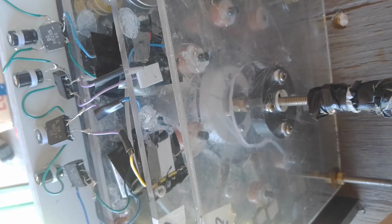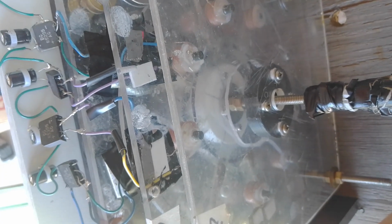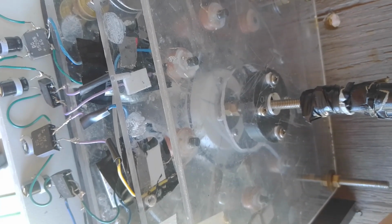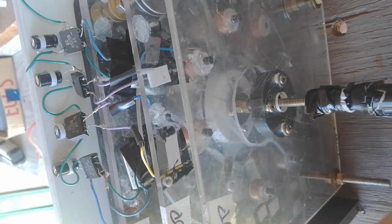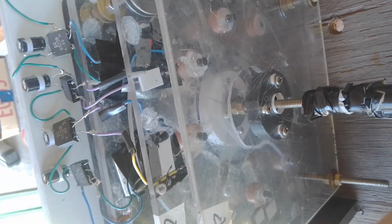And I did this yesterday, but I forgot my camera. But I got 84 volts and 314 milliamps. We'll check that out. That means when I crowbar it for the maximum amps, which means there's no voltage, I get 314 milliamps. And if I just check the voltage, what is the maximum voltage with no resistive load or anything? It's 84 volts, so you'd see. So that's what that is. That's how I check it.